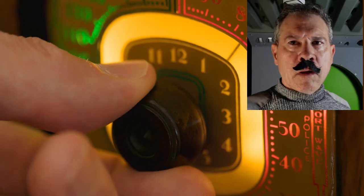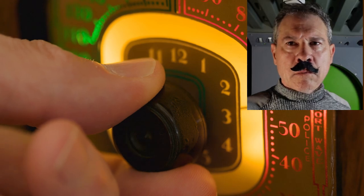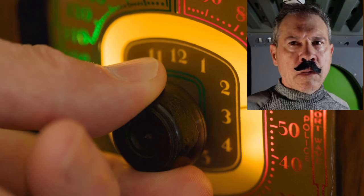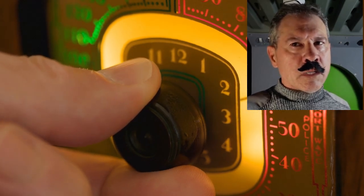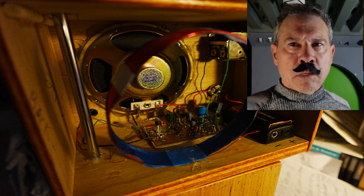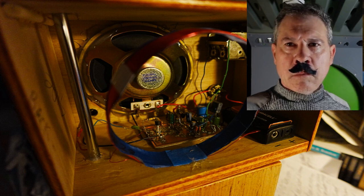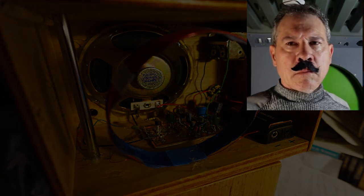It operates on 1.5 volts, so a voltage regulator or a voltage divider must be used if you are using a 9-volt supply. The TA7642, the MK484 and the ZN414 radio circuits are all over the internet. Adding a TA7642 to my homemade AM radios has greatly improved their reception, allowing me to receive 5 radio stations. On a skip or DX, I have picked up Los Angeles, 787 miles away. That is without a ground lead and only a 20-inch vertical antenna. Let's get started.